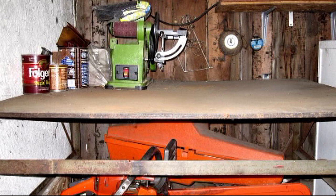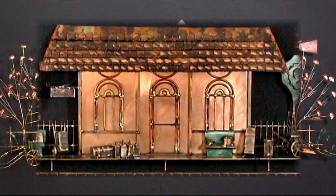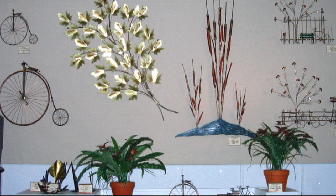This is another 3-foot by 4-foot welding table with a half-inch top. I didn't think that one could warp a half-inch piece of steel using just a small torch, but you can see here that this table is definitely warped. When I'm doing pieces like these, I need the table to be absolutely flat, which is why I am so conscious of not wanting to warp the steel tabletop.